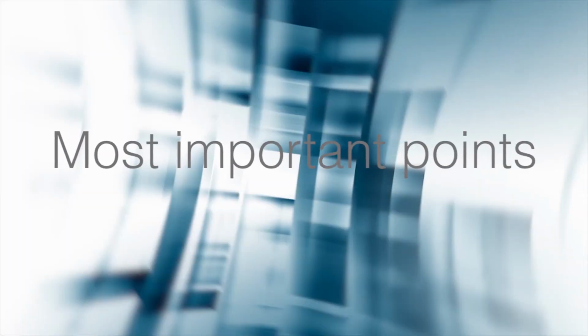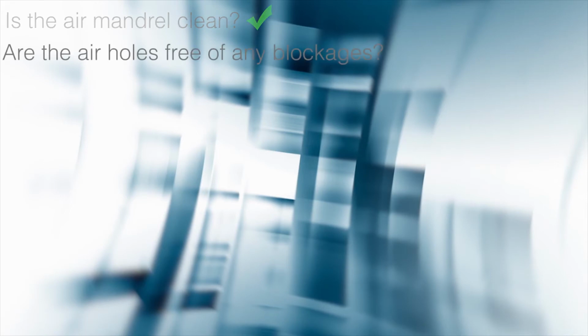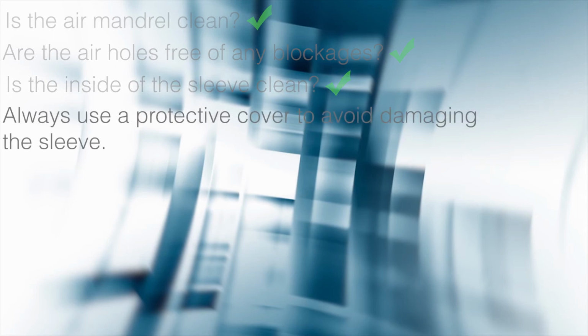To summarize, here are the most important points you need to consider during mounting and dismounting. Is the air mandrel clean? Are the air holes free of any blockages? Is the inside of the sleeve clean? Always use a protective cover to avoid damaging the sleeve.